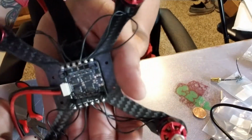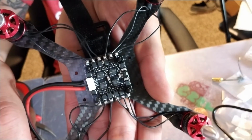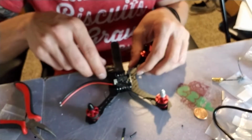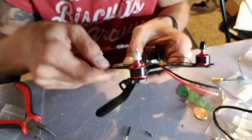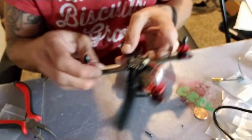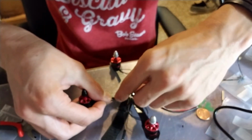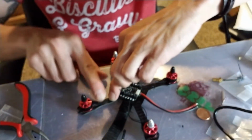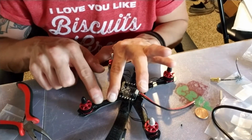So let's take a look at those solder joints. See, looks good. I'll go ahead and flatten and clean these wires up. What I like to do is take them all, kind of tricky, but get them all positioned where I want them, and then I start folding them and pushing them underneath the pad so that it ends up looking like that. Let's get that in focus, sorry.